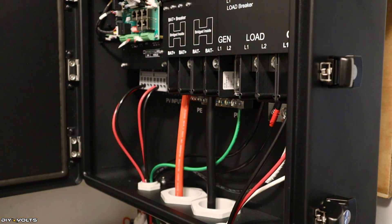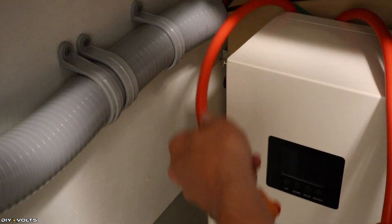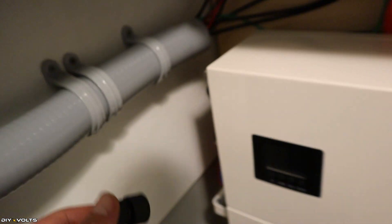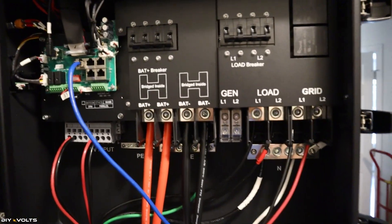I'll get the other two installed. Because of this cramped space, it's going to be very hard to see me attach the battery cables to my Ethos big battery, but the black terminals are on this side and the red terminals are on the back side. You can see where the black and orange cables are now attached. The last thing I need to do is attach the communications cable to the inverter. Right here on the bottom there is a port I'm going to unscrew, and then the communication cable from the battery will go up here to the COM port on the inverter. That will allow the battery to talk to the inverter so they will know what state they are in. That concludes the wiring of this unit.